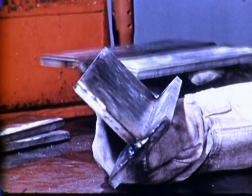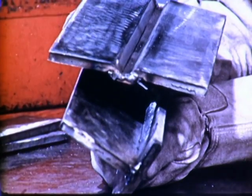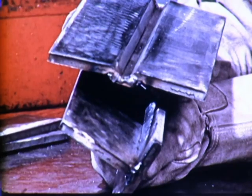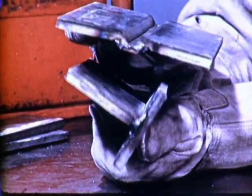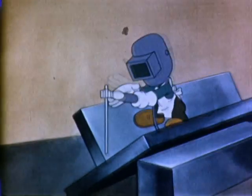The flat groove is comparable to the flat fillet, except that there may be an opening at the root of the groove, and the angles of its sidewalls are likely to be less than those of the fillet. In flat welding, as in other positions, we are concerned with four main factors.